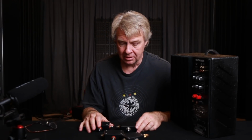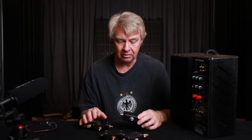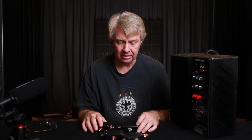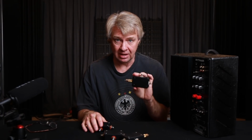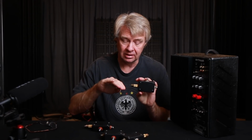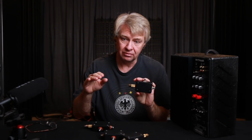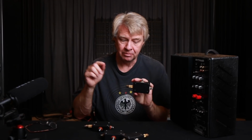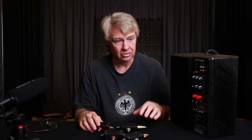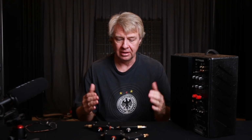On my preamp, there are three outputs, and two of them are full range, one of them is restricted a little bit. Again, the cap value that you need depends on the input impedance of your amp and the target 3 dB down point you're trying to hit. Keep in mind, if you want to cross it at 50, then you need a cap that's going to be 3 dB down at 70 or 80. Remember, it's a gradual slope. Then use your subwoofer to balance it out. So I hope all that made sense.